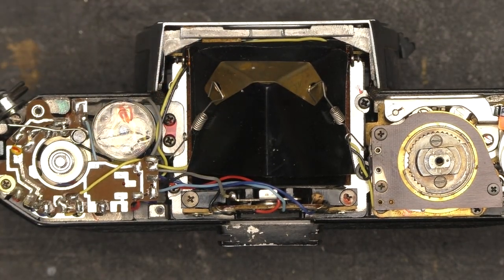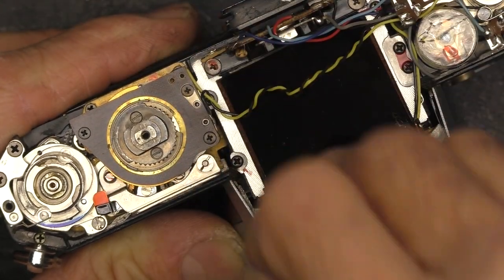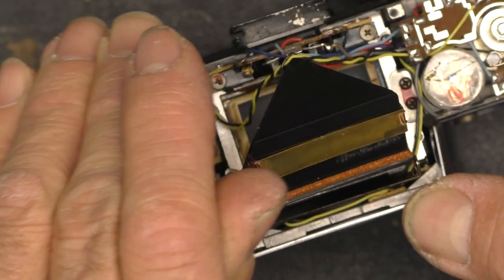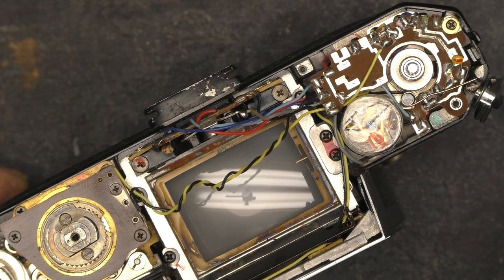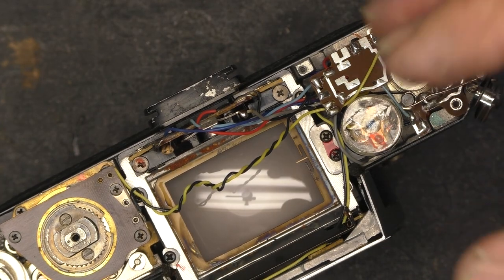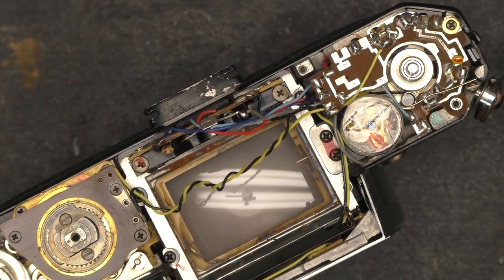So we're going to loosen these first. There's the meter — the needle is right there and the actual meter is right here; that is the winding for the meter. The meter is basically a volt meter. All of these meters — VU meters, light meters, any needle sweep type meter, even an old volt meter — act like a motor in a way. There's an inductor and magnets, and depending on the voltage going into it, it offsets from the magnet a given amount and the needle moves.